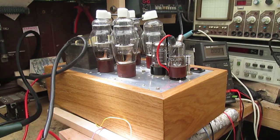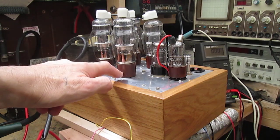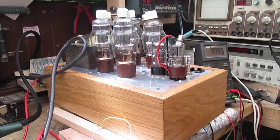What are matched valves and does it matter? We're going to put the scope on and the audio analyzer and see if it matters. When guitarists buy matched quads or matched pairs, very rarely have I seen on eBay any mention of what test conditions they were tested at - were they matched to 5%, 10%, 15%, 20%? Are they matched in terms of emission, GM, or both? And if you test those valves at quiescent current and then bung in a sine wave and test again, you get different conditions.